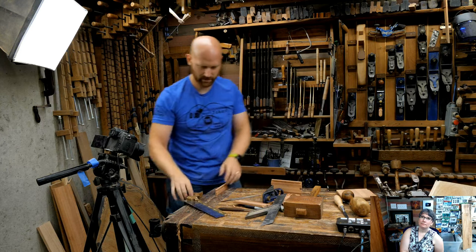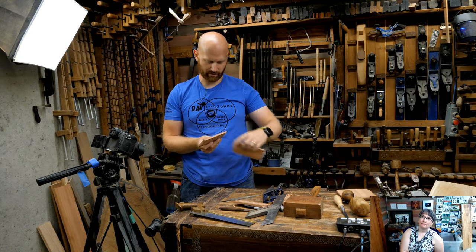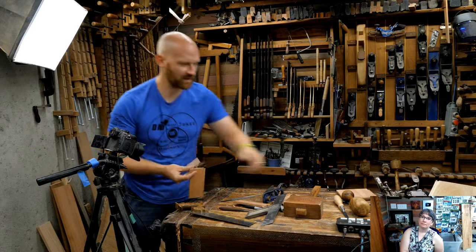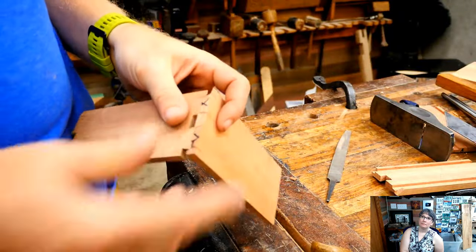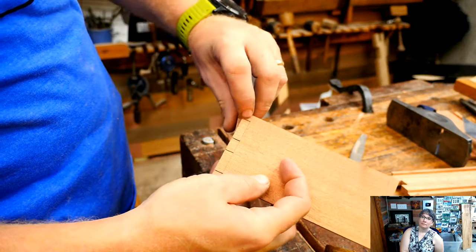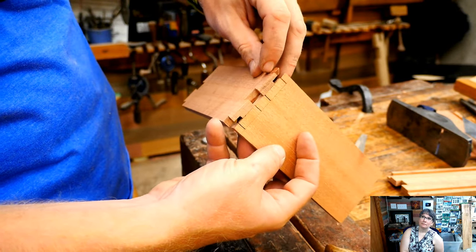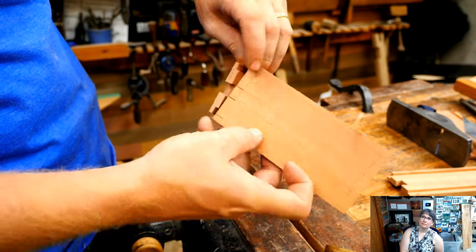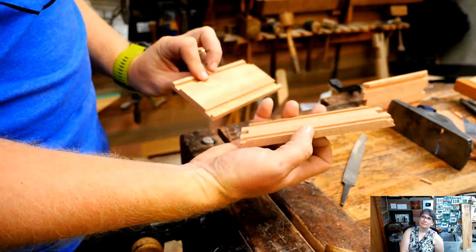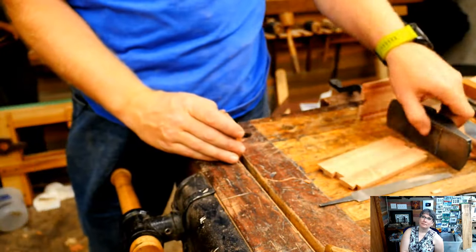And I just realized that I'm going to have one of these corners that actually is a good miter dovetail now because I cut all of those that way. Oh well. I'll explain what I'm doing here. Let me show you. When these come together, focus in, there it is. When these come together, I'm going to have this saw kerf line here and this saw kerf line here, and I keep forgetting to not make that saw kerf. So I'm going to do it on this last one and not make that saw kerf on this side. So I'll have one side of one corner that's still good, which is going to go front, right, that way. So let's do this one.